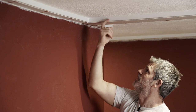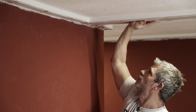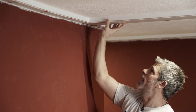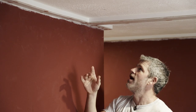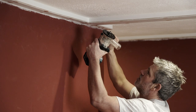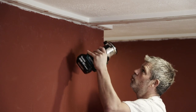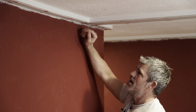The beam pieces run down the middle and we see both sides, so it's very difficult to cut them exactly the same size, glue them up, and nail them overhead without shifting. So I cut them a couple millimeters proud, leaving a tiny overhang on either side to clean up with a router and flush cut bit. My large router is completely useless overhead, so I borrowed a friend's Makita cordless router, which should do the trick.